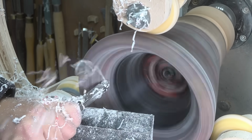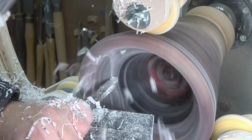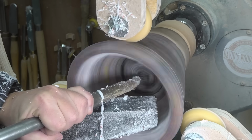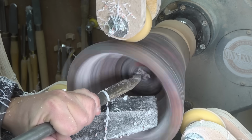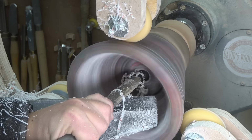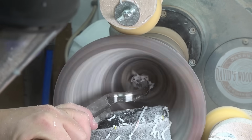As you can see, that black thing on the inside is a 3D printed insert which helps me to reduce the amount of resin needed when I cast the piece. And it is super easy to turn. Obviously this is waste, and unfortunately it cannot come out, so it can't be recycled, but it's very cheap to print, and I have a small little 3D printer, so I'm able to produce them. But again, it produces less waste and speeds up the process of making the project.